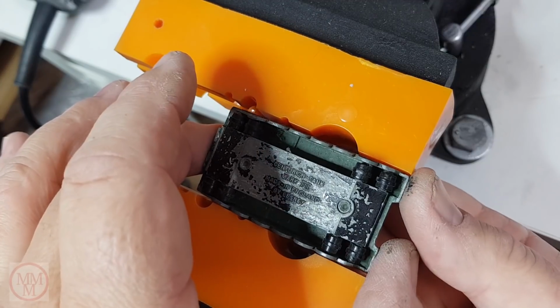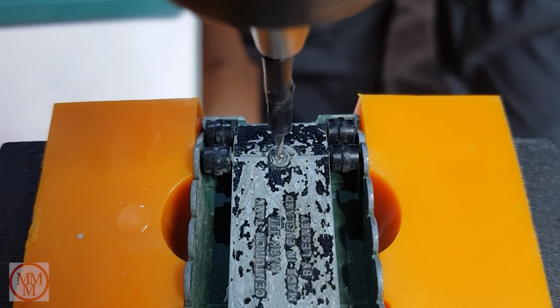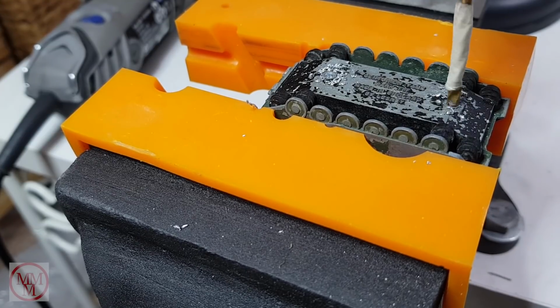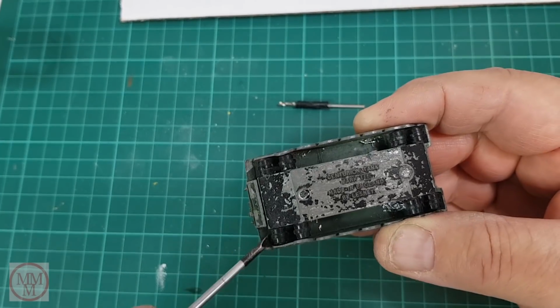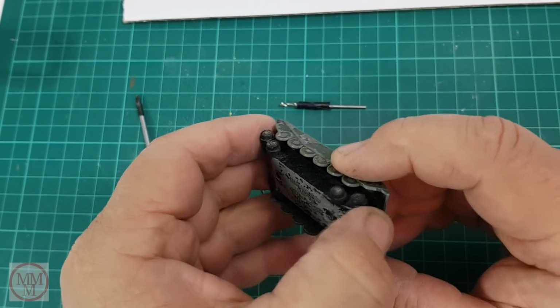To get the turret off, I've got to remove the base. So first off, I pre-drill the centre of the large rivets on the base. That way I can tap them later to put screws in to refit the base. Then I use a larger drill to take off the head of the rivet and lever the base off with a small flat-bladed screwdriver like that.